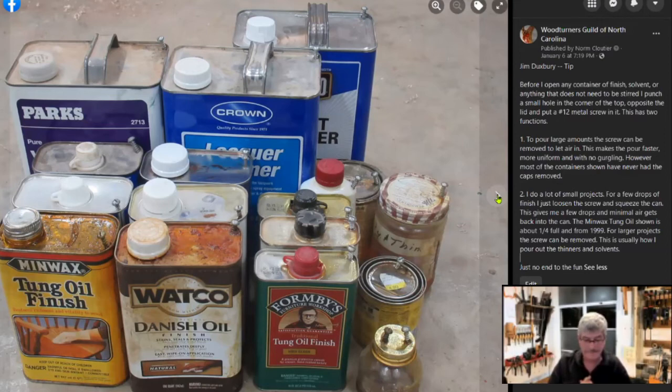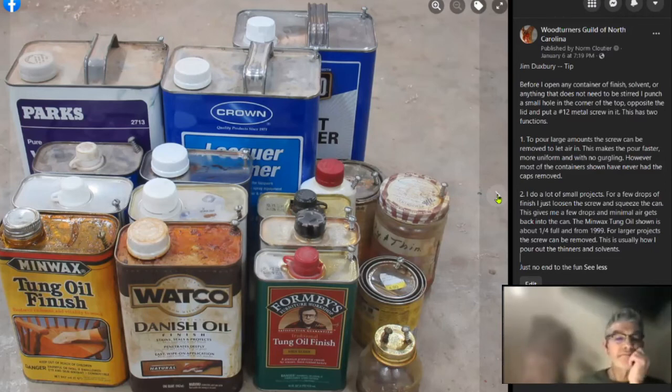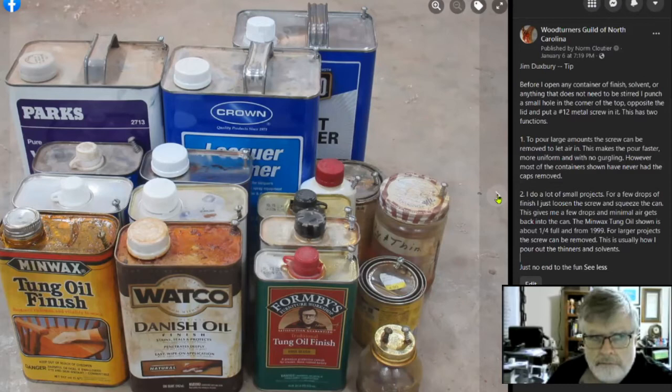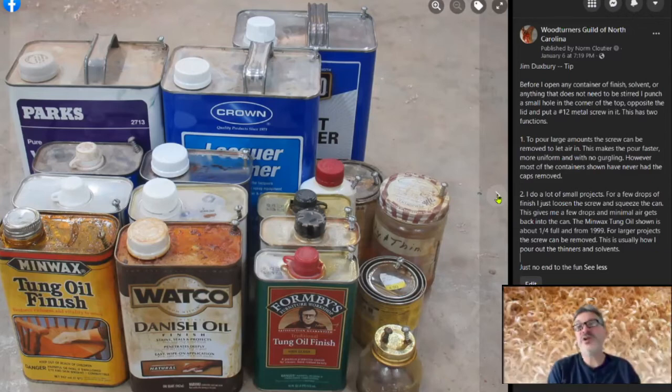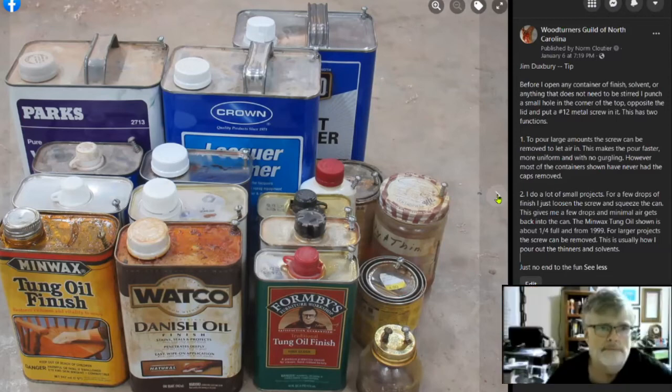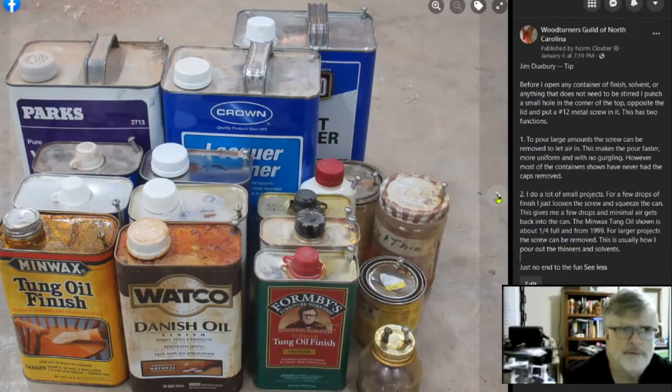Yeah, if you try to collect shavings, I don't care if you have a 4 or 6 inch system or whatever, it's going to clog on those big shavings. I haven't found anything that'll get the shavings. You just have to let them go to the floor. It plugs up stuff, but also you just end up emptying stuff and cleaning it out constantly. And a lot of them are going to come at you anyway and never hit that system. Yeah, you're better off to let those hit the floor and just go after the dust. You switch from the left to the right hand, it goes a completely different place anyway.